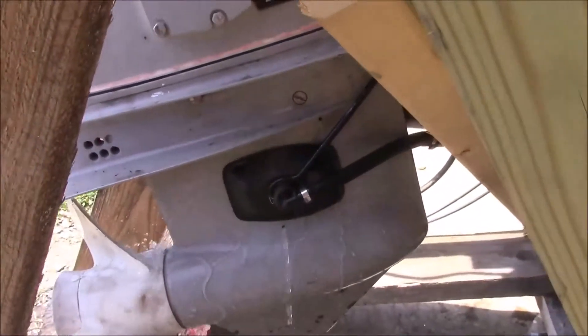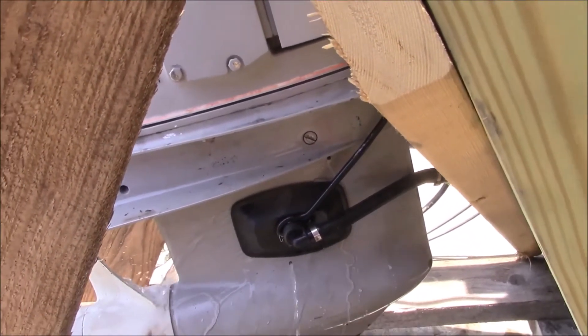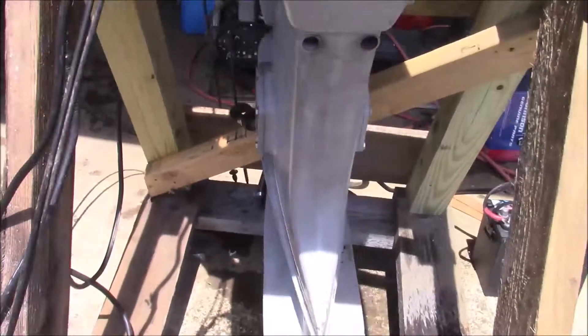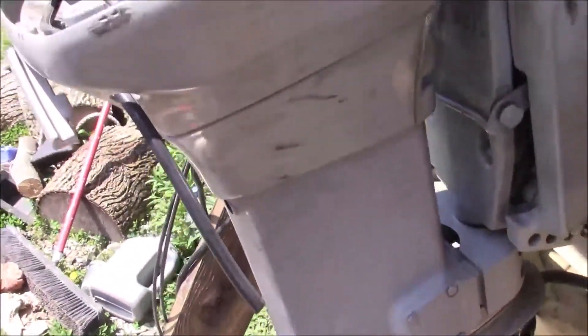One of the things I'm going to make sure is that it's actually pushing water into the pump. I got burned on the other one literally because I must have gone through four or five cycles and just wasn't getting it to pump water. I can see from this one that it's actually got a decent seat, and the way I can tell is it's coming out of this little hole right there and that one up there, so I know it's getting up to the pump.